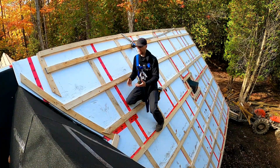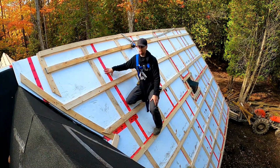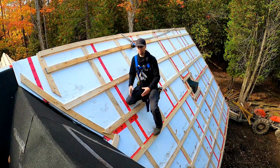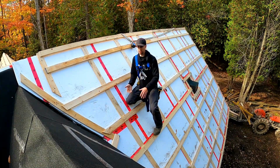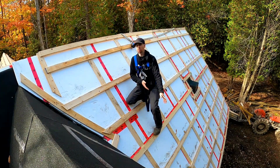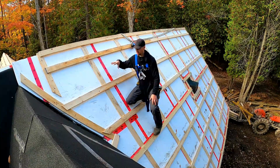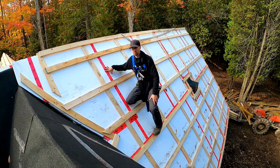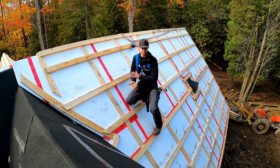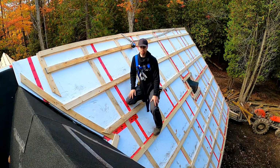So the way I've done it here is that if there is moisture that condenses on the underside and it drips off, it will fall onto the foam board insulation, and it has some space to drain underneath the horizontal straps. So these vertical straps really just help to hold those horizontal straps off, and it allows the moisture just to drain off as quickly as possible without getting hung up anywhere. And even if the moisture drips off of the steel and finds its way through the foam insulation, which it might in some cases, it'll hit the leak barrier and still find its way off the roof. So no matter what, we're covered as far as moisture goes.